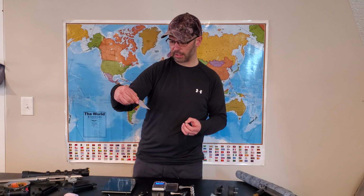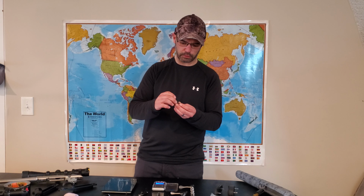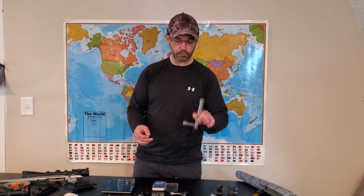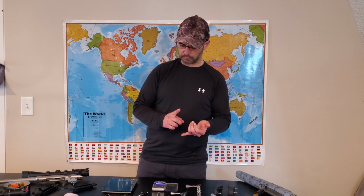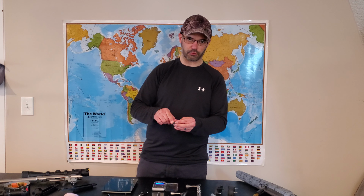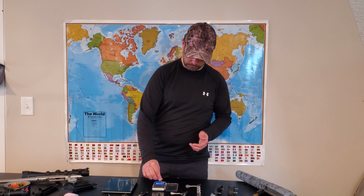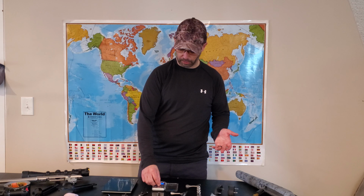So this one, this little titanium one from a company called High Velocity Hunting out of Australia, has two little screws that you can take out. If you've got both of them in there, that's going to essentially put the bolt stop in the position that your factory 223 bolt stop is going to put you at. You take the first screw out, and then it puts you in line with the standard action, and you take the second screw out, and then it's in line with your magnum action bolt stop positioning. These little screws, told you we're talking minutia here, are 0.65 grams, okay?